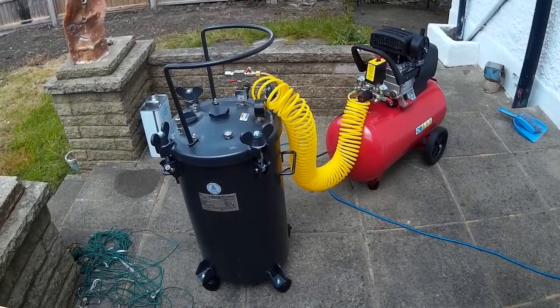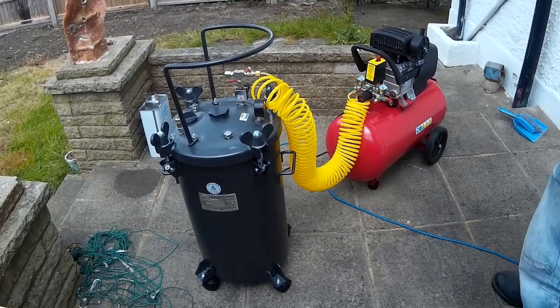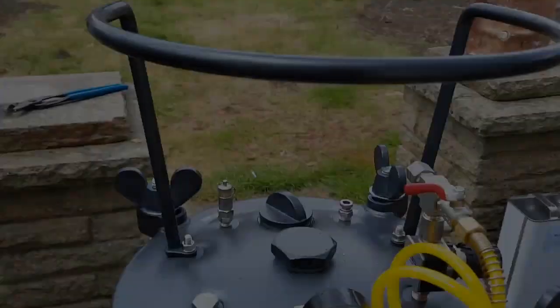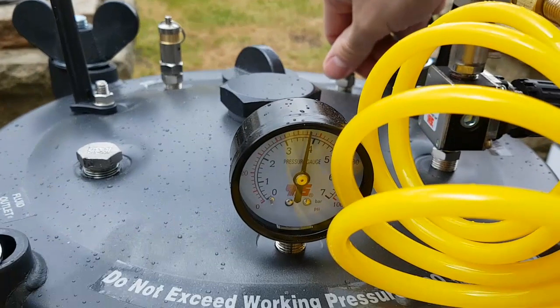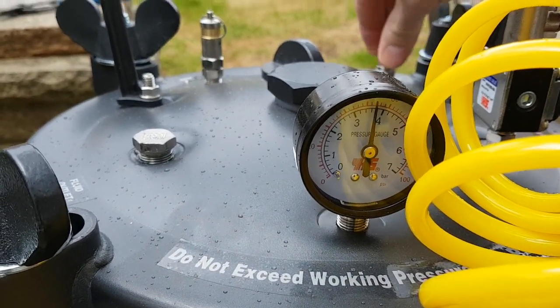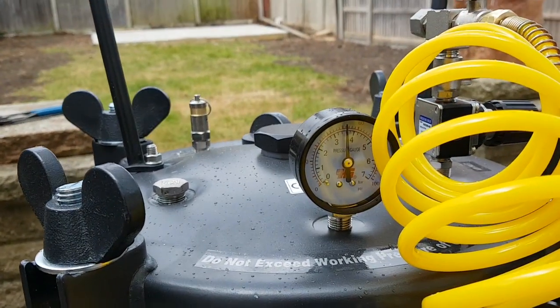The process is the same as any other casting process — give your piece sufficient time to set and then come back to the chamber. Once we've done that we need to release the air in the chamber, so in order to do that you just loosen the release valve. You can hear the air rushing out and the pressure on the gauge is beginning to fall.